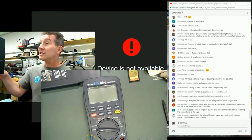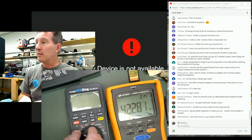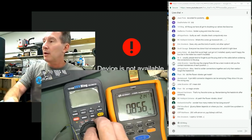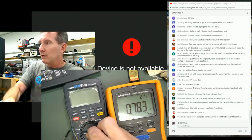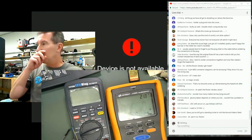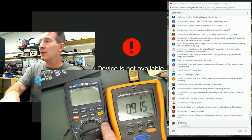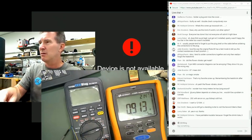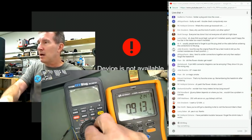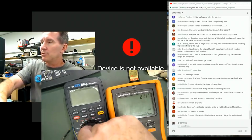11? Yes. 6,000. We did another 1,000. Yeah, you're right. It's 11,000 cycles. Thank you. There you go. 0.8 ohms. I mean, that's done 11,000 cycles, and we're on 0.85 ohms. And if you wiggle it, it changes a little bit, as you'd expect. But 0.9, that one's longer for some reason. It has always been slightly higher in that position. Maybe it has longer tracks. The tracks shouldn't add much, but maybe it uses a different set of contacts or something in that position.